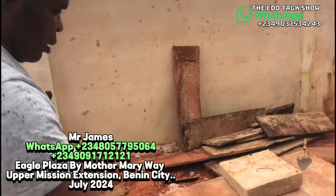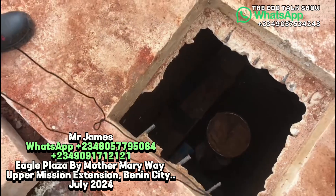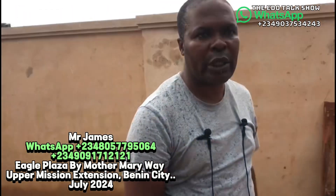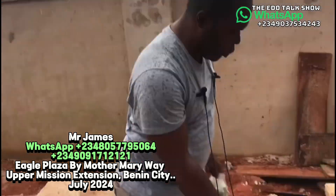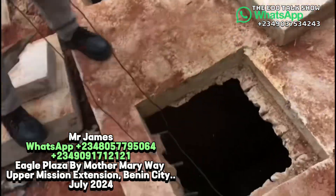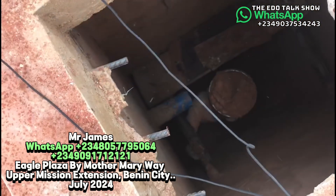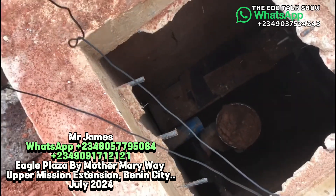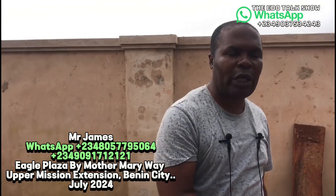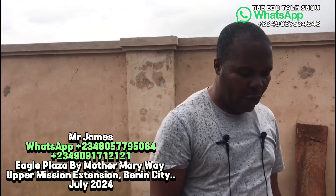You can see one of my staff working inside the tank. What I normally tell our clients is that not everybody does this work the same way. Some people finish the soak-away construction and cover it immediately without removing the plank and without cleaning inside. Look at what my staff is doing — moving the sand to ensure it becomes neat for water to properly absorb. All the planks are being removed. Some people leave planks inside to decay, and once they decay they block water absorption and cause problems. But none of our clients have ever called to say water is not soaking.